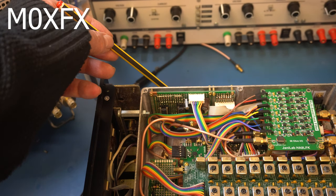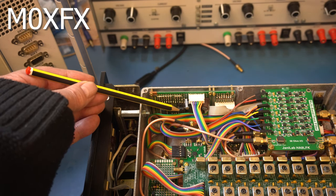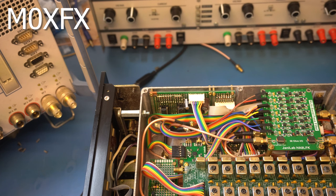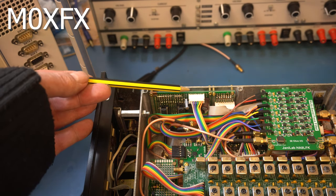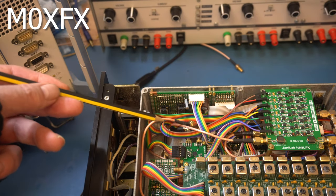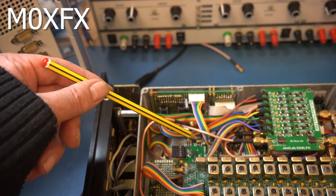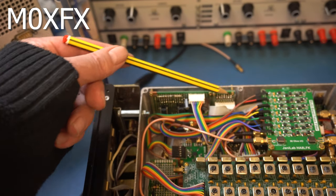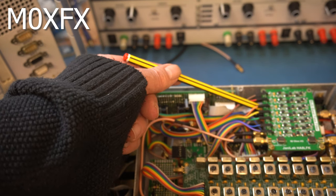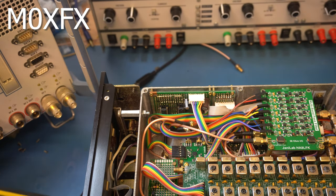The DC lines plug in at the back. Inside we have some CMOS ICs — I think they're CD4028, a BCD-to-decimal converter. From the microcontroller we send a code and we know which band we're switching on at any point. We also have the switch-over from UHF to HF and the relay that switches the preamp on and off.